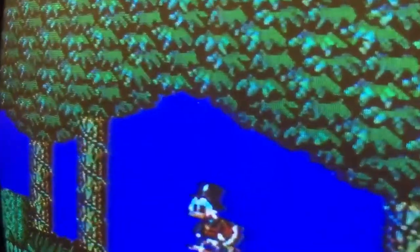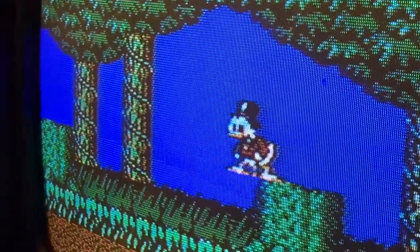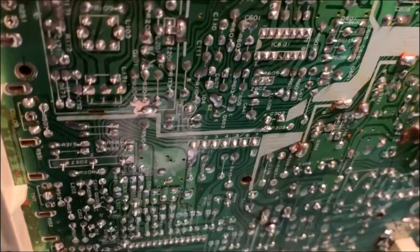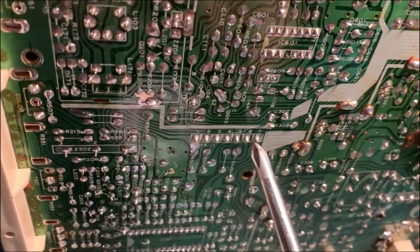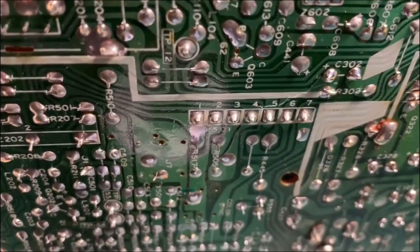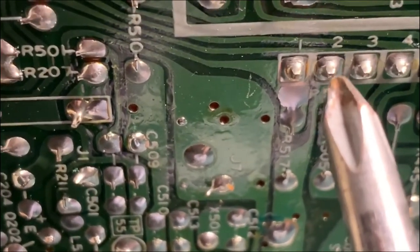This is excellent picture quality — as good as it gets for composite on a 34–35 year old TV. All it took to fix this TV was two capacitors and reseating the yoke plug. We are going to reflow this connector that was causing the auto color button issue — it's right here. It doesn't look like any of these are dry joints or broken, but I'm going to do it anyway since I've already made the effort.